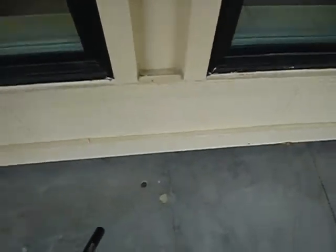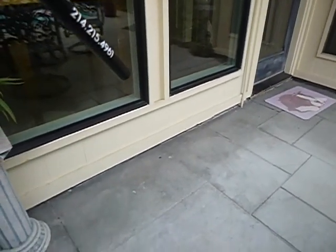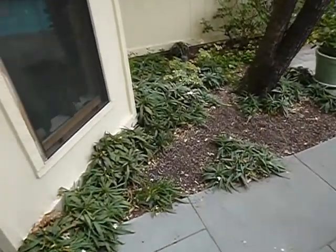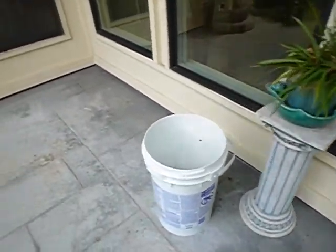Over here, and you see a drill hole like this. There's some more. There's only one reason for that drill hole. It's somebody was applying product. That's code for poison. So what's happened is the only poison that you would apply that way is for subterranean termites. So we know, so far, haven't been inside yet, we know the structure's been treated at least once for subterranean termites. We don't know who treated it. We don't know when it was treated, and we do not know what it was treated with.